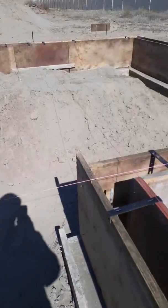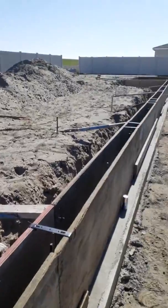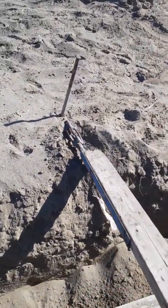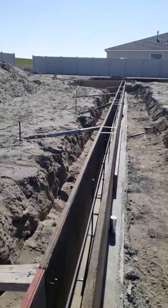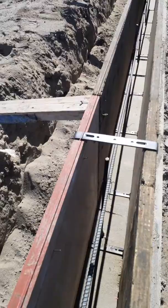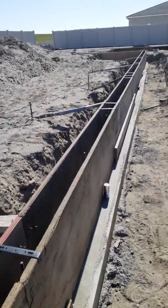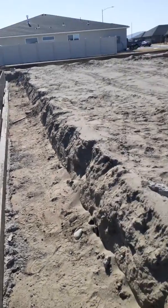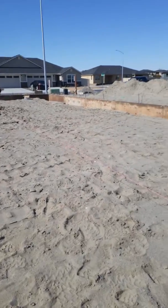This is what I'm up to today. We just got this new foundation finished — it's all formed up as you can see. Got braces with turnbuckles on them so you can adjust them forward and backward to make this wall straight. We have a string line here to make sure the wall is perfectly straight so that when the framers come in, it's all ready to go and looks good.